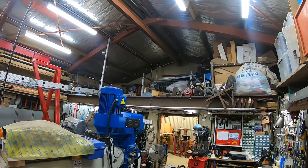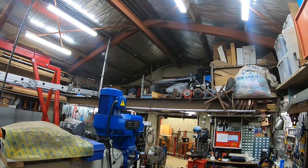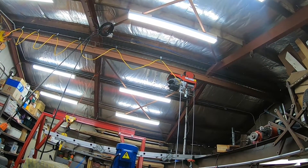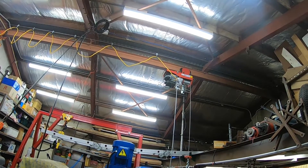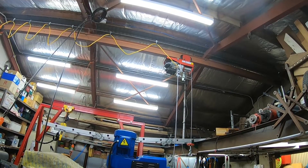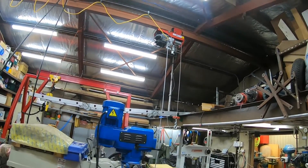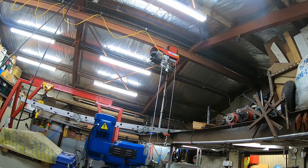Those accessories are really quite heavy, and using a chain pulley to put them up there is very tedious. I've got to lift up through about two to three meters, and there's a lot of winding. So I wanted to do things differently and decided that an electrically powered hoist was the way to go — much more suited to the longer drop or higher lifts. This hoist is rated for 800 kilograms — actually 400 and 800 if you use a pulley to double up the rope.